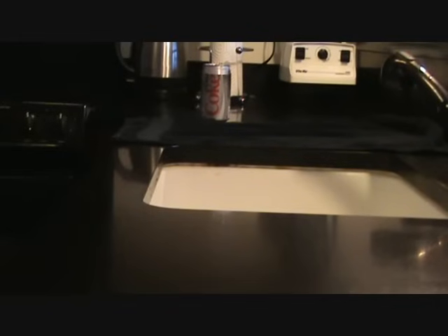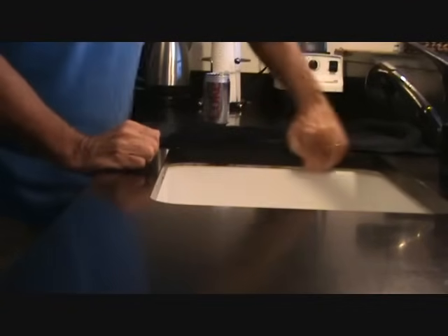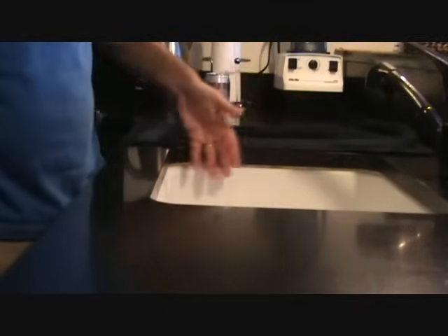I really don't have any missing caulking under there, but look at how dirty it is. That's mold buildup and just scum. So if anything, I need to clean that before I re-caulk. Because if you just try to put caulking around this edge, it's not really going to stick very well to all that grime. If you've got any mildew or mold there, your caulking is not going to stick well, and maybe in a couple months it might start peeling up because it's not bonded tight.